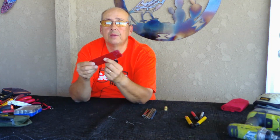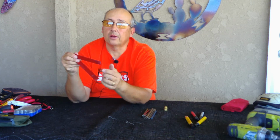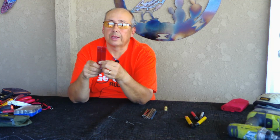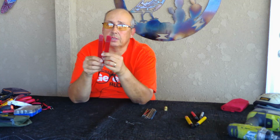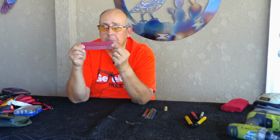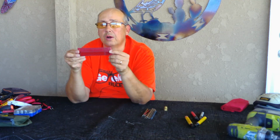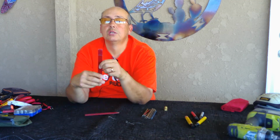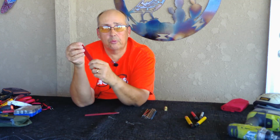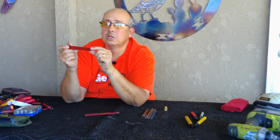I carry a couple of these with me. These are nylon, they call it Exacta Plastics out of Corona, California. And they are separators. I use them for a lot of things. They are used in the military, and that's how I got these. They separate panels on aircraft with these things. And according to the technical orders for aircraft maintenance, they can only use them once. So here's one that you can't really see the tip, but it's got a little bit of gouges on the end of it, but it's still tapered real nice. But because it has those gouges in it from wedging between the sheet metal panels, they throw them away.